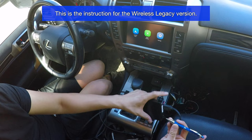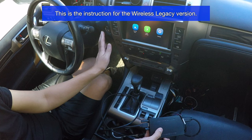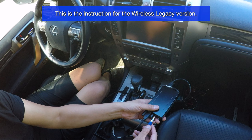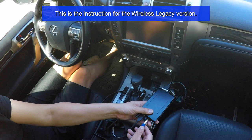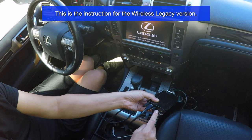Turn on your CarPlay screen. Next, use the UPG button — use a ballpoint pen and gently push it in until you feel it click. Once you have a feel for it, turn off your car. Then turn the car on while pressing the button — you don't have to press hard, just feel the click, keep it held in, turn on the car, and count to three: one, two, three — then let go.